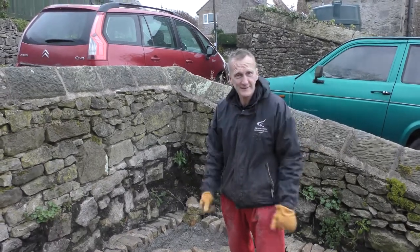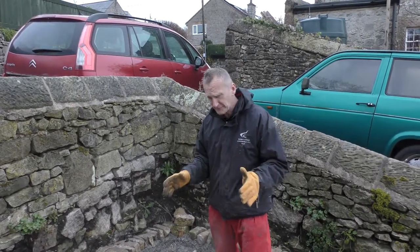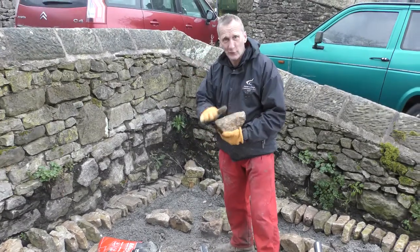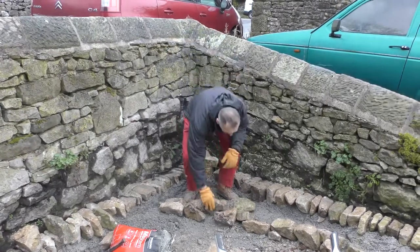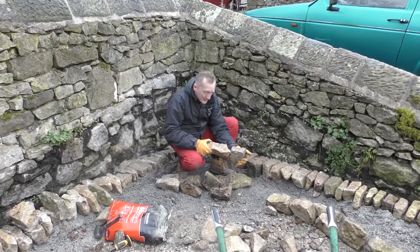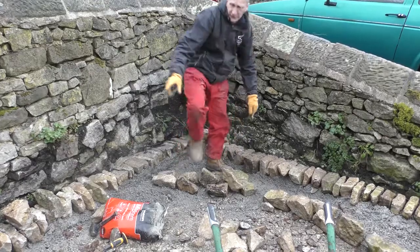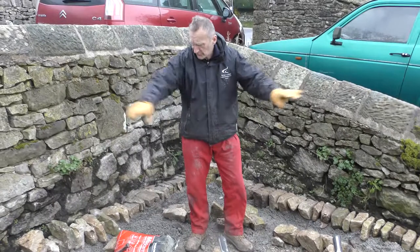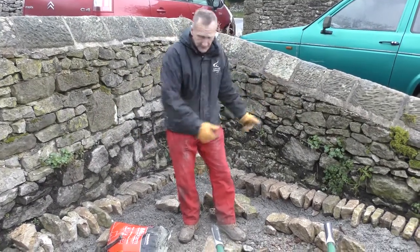Here we are at Overhead — it's a slightly wet day but we're going to do some limestone pitch paving. You have to sort out all your limestone so you get an even thickness. I'm sorting here so that we've got a reasonably even set of stone. Then we're going to create arcs — we've got this quadrant which we've framed by putting the limestone pitch on edge.